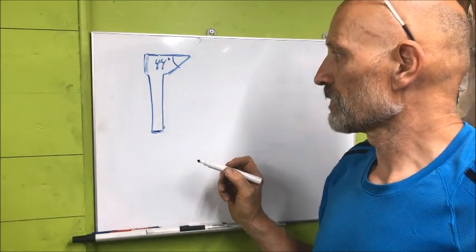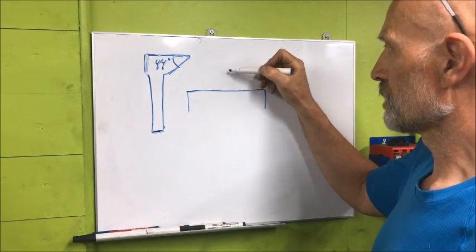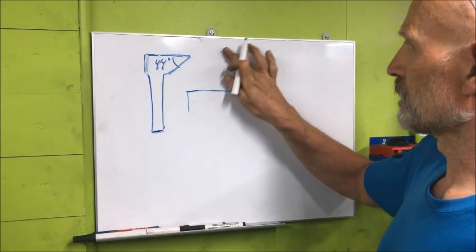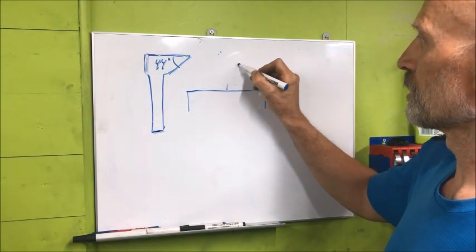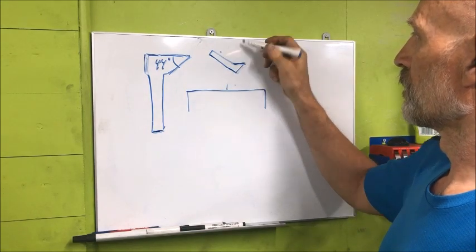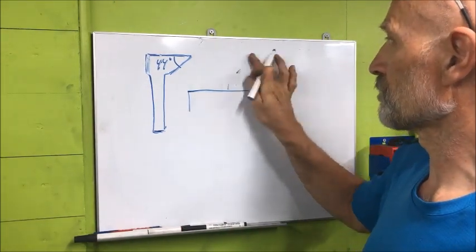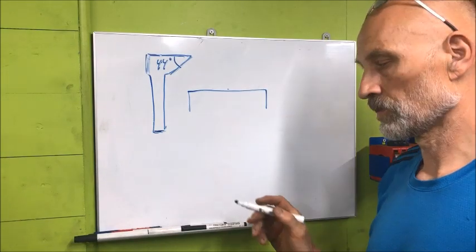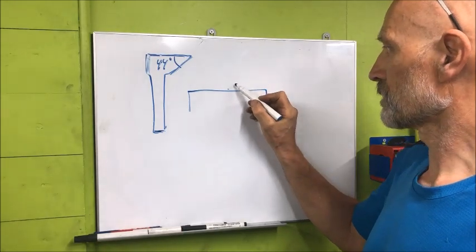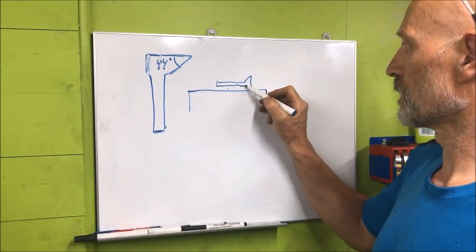So having thought about the setup, at the planer we have seen that others have set it up like this, and then flipped it around so that you get exactly the work pressure down to table at any instance. That was of course preferable, but it was also a trial effort. So I thought that it could be okay to mount it lying, as I've done when I have milled them.